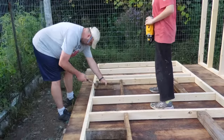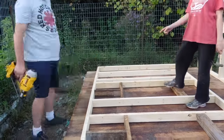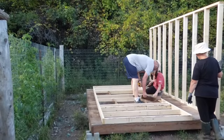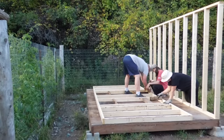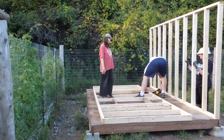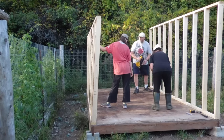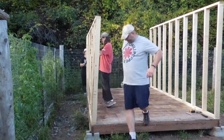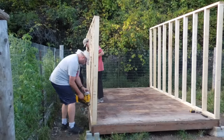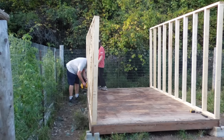You always want to put support on your headers and footers, and Casey's helping out making sure we get them in the right spots. Then we'll be ready to pop this wall up. Just like that — we have two walls on. I was checking the floor because sometimes with the nail gun the nails can go the wrong way and end up puncturing my vinyl floor, but he was lucky — there was no puncturing. We now have a standing wall.